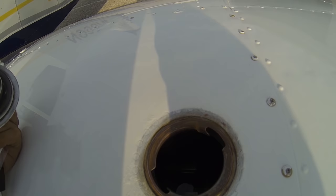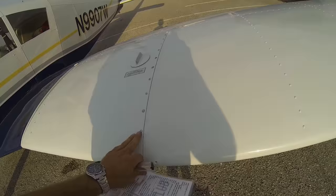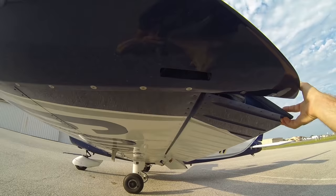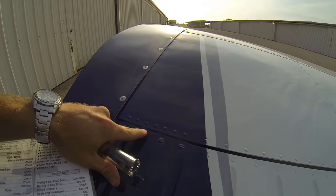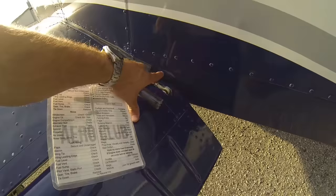We'll go ahead and check our fuel level on this wing. Besides the checklist items, we're looking at the overall health of the airplane — dings, dents, no major corrosion, all rivets in place, nothing popped out, all screws in place. Coming along this side, our nav light looks good, our wingtip looks good. We'll go ahead and put our aileron up to check our counterbalance weight — it's firmly attached, looks good. Underside of the aileron looks good, all nuts and bolts are in place, nothing coming loose. Looking at the top and at our hinges — all screws and hinge pins in place. The flap is a little bit loose, which is exactly what it's supposed to be — not bound up. Our actuating rod has a little bit of free play — that's perfect.